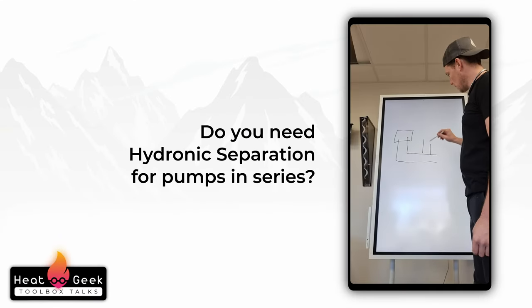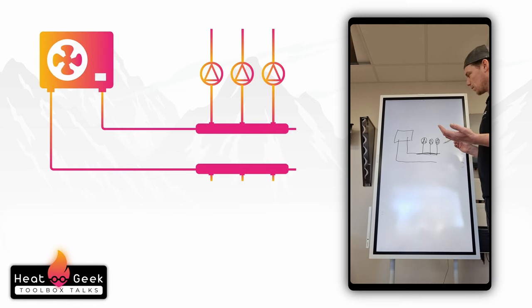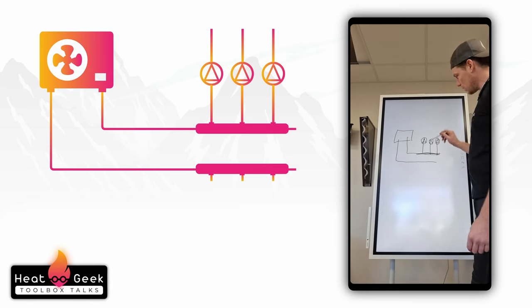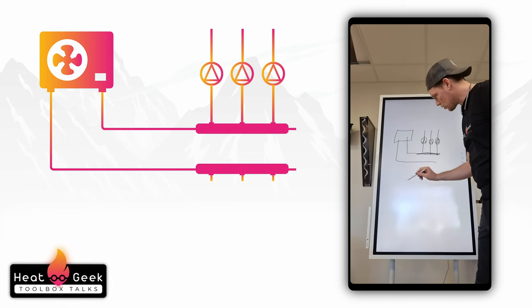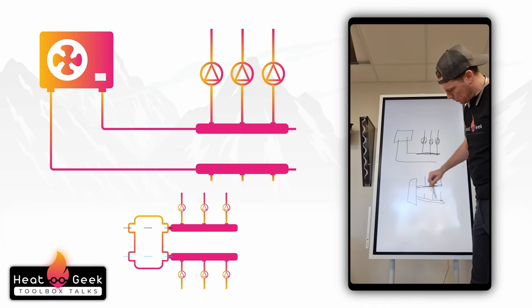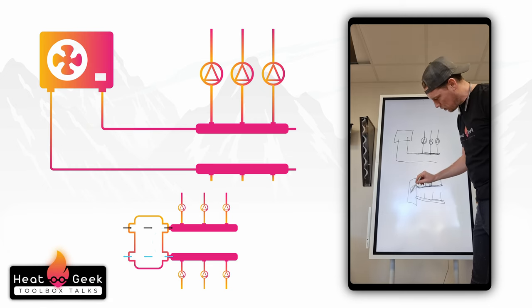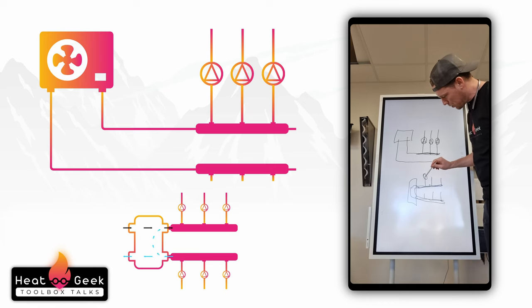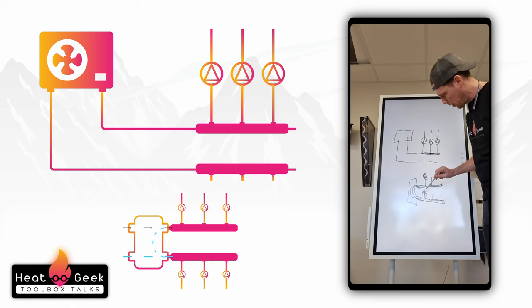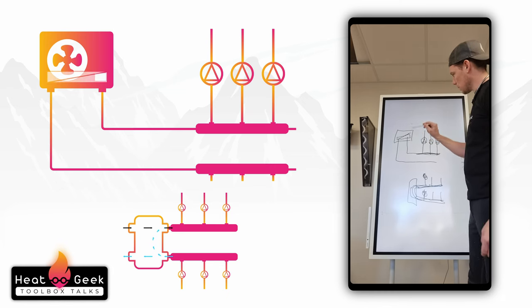If we're coming from a heat pump and we had three pumps, this with a heat pump won't work. Pumps in series is something we need to experiment on because I'm not entirely sold. Let's go through the theoretical correct answers. In theory this won't work because when you have hydraulic separation — let's put it at the low loss header — the distribution header is effective because these pipes are larger, so there's no pressure loss, and the circuit is huge, so there's no pressure loss. When this pump comes on it can easily put on its own return. But the minute we go through a plate heat exchanger — that's a plate heat exchanger symbol — it changes things.